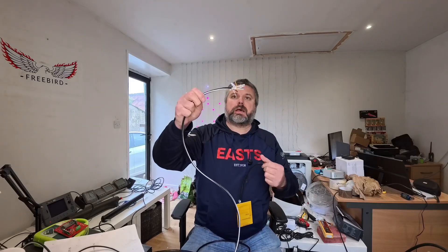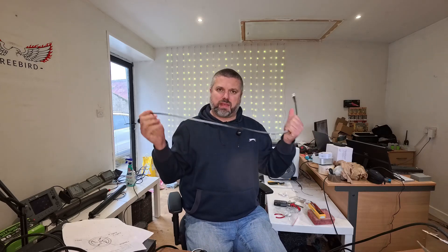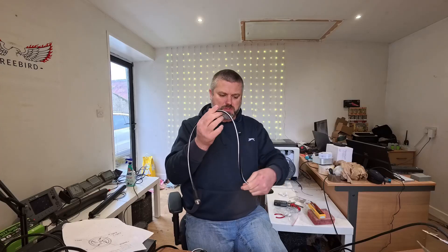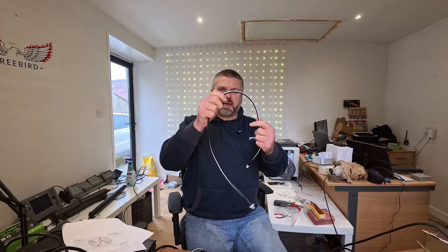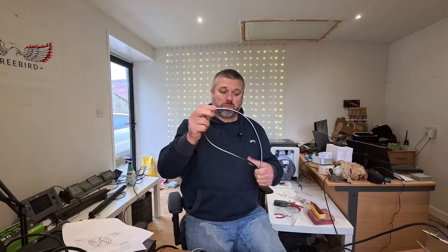The plan now is to add one of these connectors. I've made one SeaTalk NG to the normal connector. One of the lessons learned here was I cut it off at the end and basically ruined one. If you get a metre cable — about 34 quid — you can cut it in half so you get two connectors, making them 16 quid each. Funnily enough, Raymarine actually sell them with one end and bare wires and charge about 35 quid, so you're basically cutting the price in half.